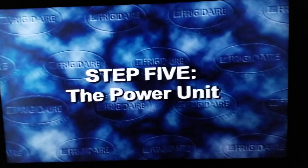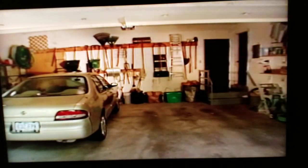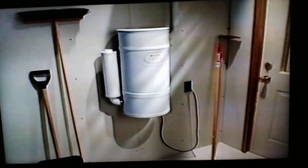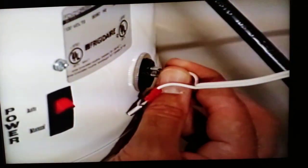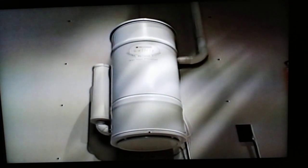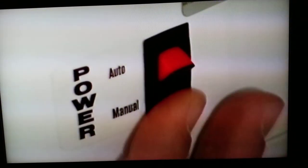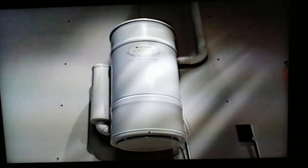The final step involves installing the power unit. If you locate it away from the living areas, you'll vacuum more quietly and at less restricted times. Detailed instructions for mounting each manufactured model are included with your kit. Remember, if you keep a vehicle in this part of the garage, install the unit so that it's not going to be in the way when the car is driven in. Now the wiring: strip the ends of the wire from the main vacuum line and crimp the stripped low volt wires into these wire crimp connectors, then reconnect them to the power unit. If you've installed the power unit in the house, such as in the basement or utility room, it's a good idea to exhaust the air outside the house — the exhaust run should be no longer than 12 feet if possible. Plug in the power unit, flick the manual override switch on and off to test it — and congratulations, you've just done it the smart way.